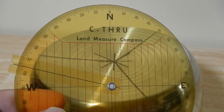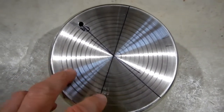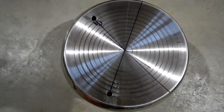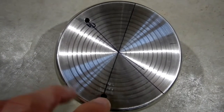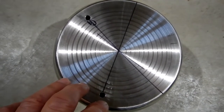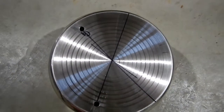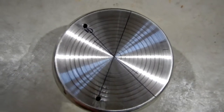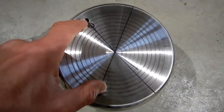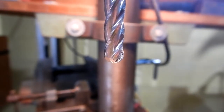There's been a change in plans. When I tried a 3/16 high-speed steel drill bit it didn't do anything — it just put an indentation in the metal. I even went out and bought some 3/16 stainless steel drill bits and neither one of them would work. So I ended up thinking about a carbide end mill, and I happen to have in my collection a quarter-inch ball end mill. I gave that a try and got two holes started. This must be some hardened alloy. So instead of 3/16, quarter-20 fasteners are fine for my three bolt standoffs.